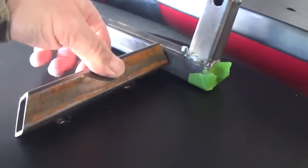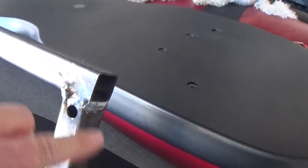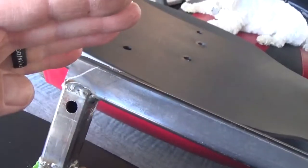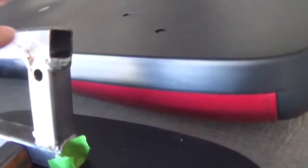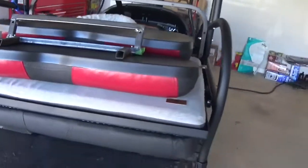I've got my leg pieces cut and I'm going to drill holes in here. Once I've got this all welded on, I'm just kind of mocking it up. I've got this square tube kind of butted up against each other — I think I'm going to try to trim these corners off a little bit, then cap them, grind everything down, make it look pretty, and then we'll paint it. I've got some flat stock here to cap the ends. Still not sure of my height for the back seat, but I wanted to get this started, mocked up, and see where we're at.